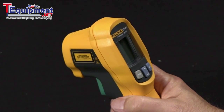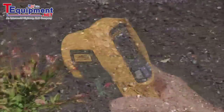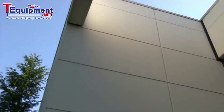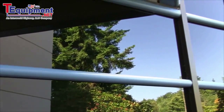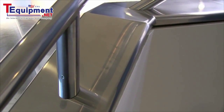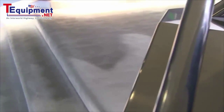The surfaces that you might encounter, a lot of them radiate very efficiently — like soil, lime, stone, paper, textiles, paint, plastic, rubber, oil, and grease — but there are some others that do not radiate efficiently, and one of them is polished metal, like the polished aluminum bus bar you may have encountered.